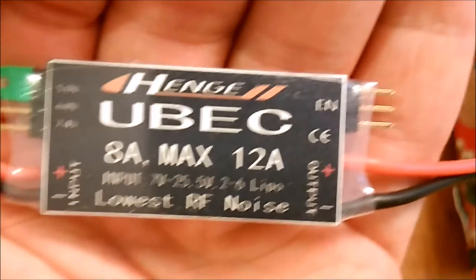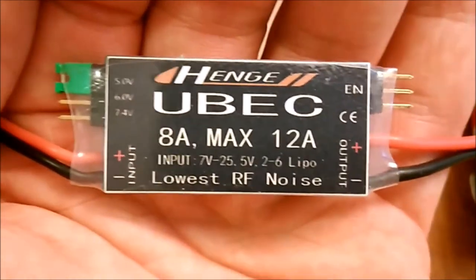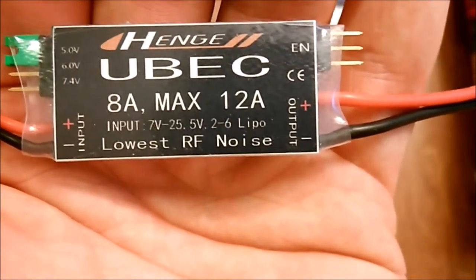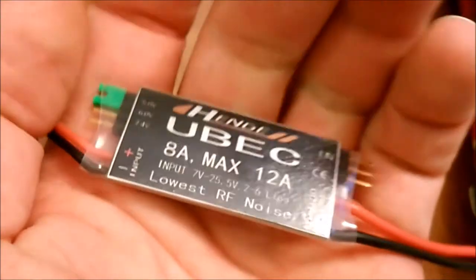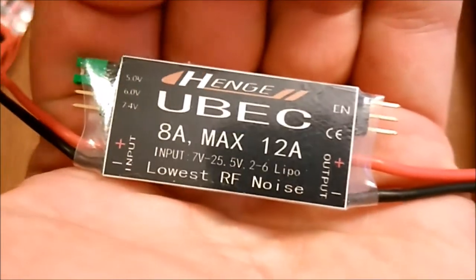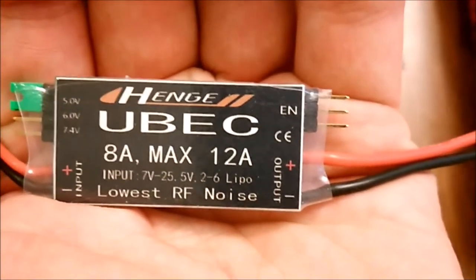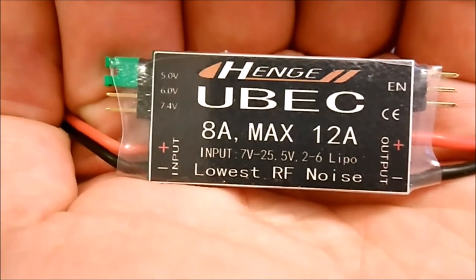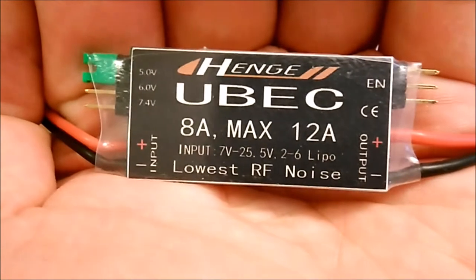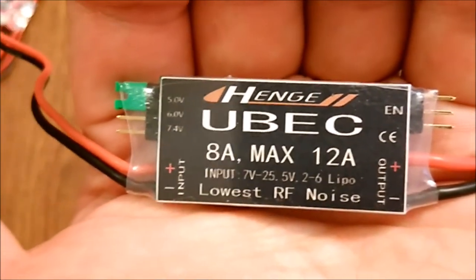On the other side it's got enable pins, which I'll show you later — we don't have to worry about that. Input and output are pretty self-explanatory. It is kind of big, which is a little bit of a downside, but 8 amps is more than one servo will ever use, and 7.4 volts is still a lot more than 5 volts. It's not quite 8.4 volts which would really max out the potential of the servo, but for that you'd need the more expensive Castle. I'm all about cheap but still good upgrades.